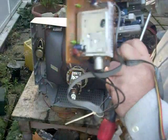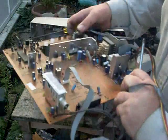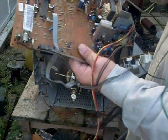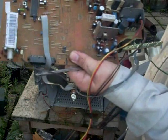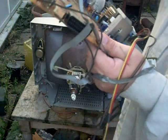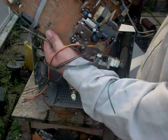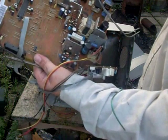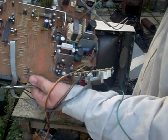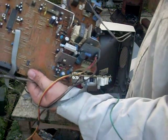There's a 100 microfarad, 400 volt capacitor. There's a high value resistor — 2.2 ohm, 5 watt — and another 5 watt, 5.6 ohm. I've just noticed — I don't know whether that's a bodge from the factory or a repair: two series resistors. But you can see this is the basic model; most of the interface chips are missing. The whole of a CRT TV is on basically two chips, with a small chip there — that's probably the switch mode power supply control chip.